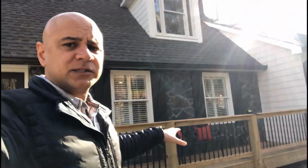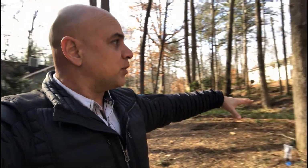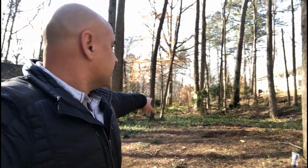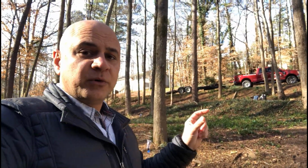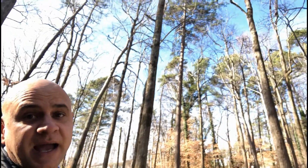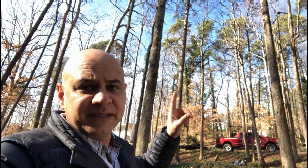We're going to place 4 lights on the front of this house, and now here's the other example. We're going to go into this natural area, and you can see I've got a couple fixtures set up here. We've got 4 fixtures going into the front of the property, and this is where I will use the narrow beam spread. I will adjust the beam spread to be 25 degrees because I have to shoot up these trees. Even at 25 degrees, I'm not going to get that light to project all the way into the top of the tree because we're not using a larger heavy-duty floodlight.